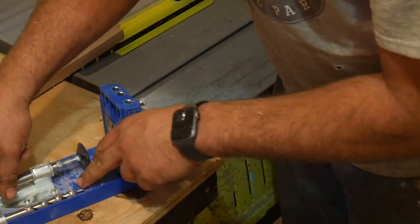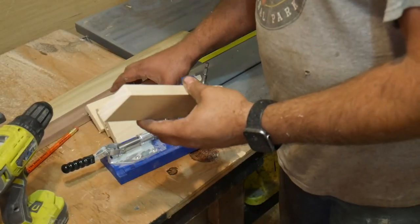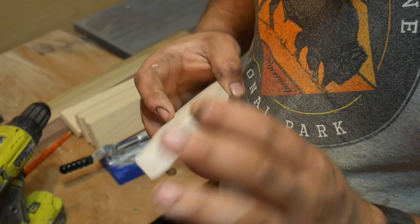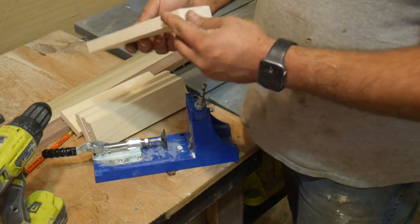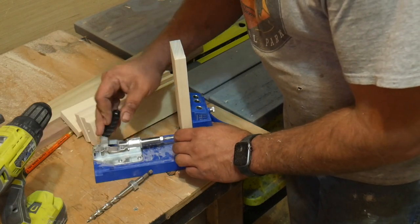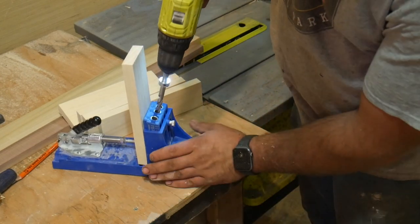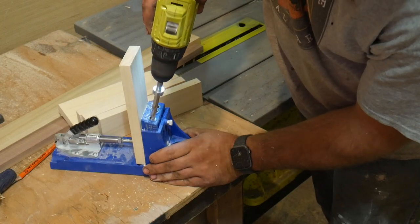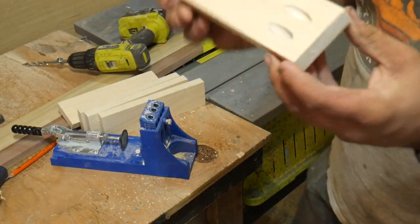So I'm going to look all these over because some of them have a little bit of mild tear-out — the blade's not great. They're just not quite perfect, and you want to make sure you put that on the back side that you can't see. Obviously you need to drill your pocket holes also on the back side. So you just somewhat line this up, adjust your clamp, and drill them in — just like that.